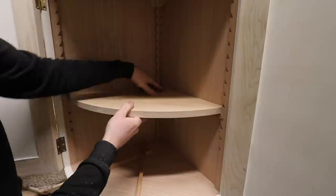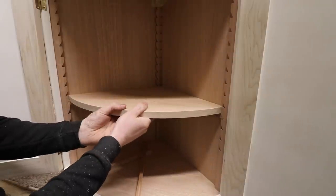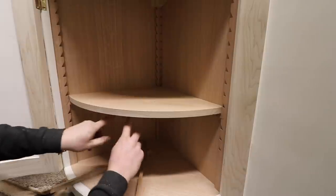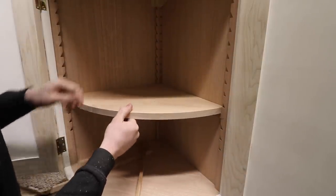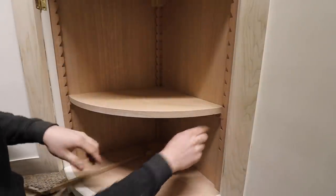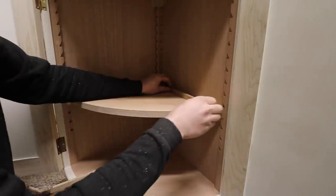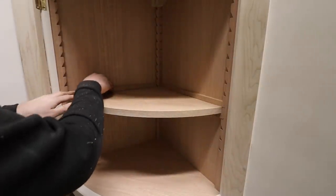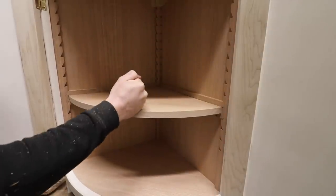So, unlike normal sawtooth shelving, when you put weight on the front of the shelf, it obviously pivots about the straight line between the two points on which it's balanced, so the shelf tends to tip. So what I've done is made the shelf thickness and the thickness of the bottom strip suit the spacing in the sawtooth strip, so I can encapsulate it with a second shelf support, and that way there's no tip on the shelf.